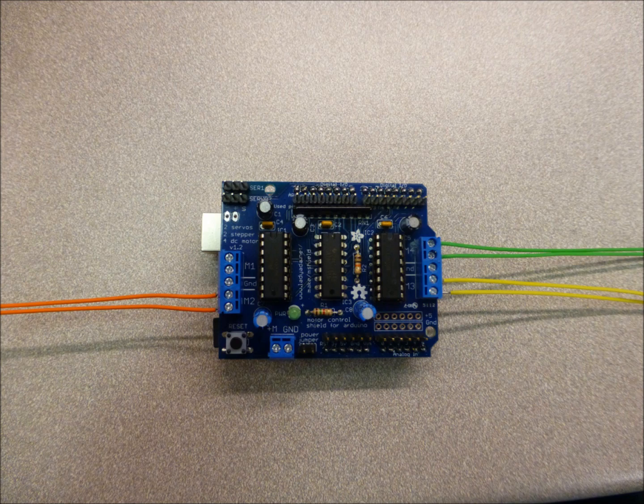The next thing is to connect all the motors to ports M2, M3, and M4 of the Adafruit motor shield. Then you'll want to connect all the pins shown in the diagram to the Arduino through the motor shield as well. Once everything is connected properly, then you'll want to load the Arduino program that is found in the description below. Once the program is running, you can monitor if it's working or not by monitoring the serial port found in the Arduino IDE. You should see the values change as your hand moves across the plates.